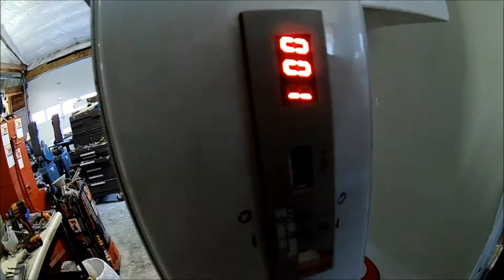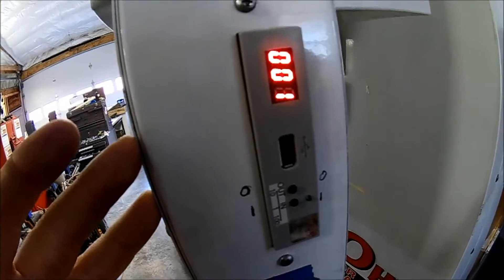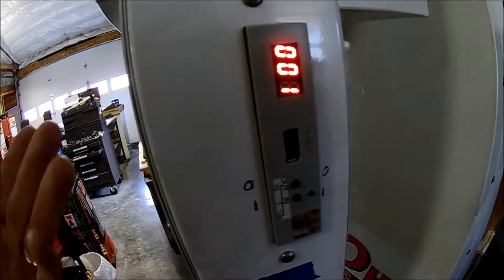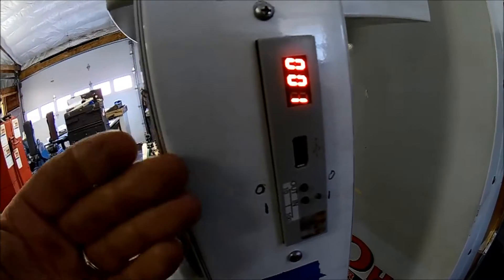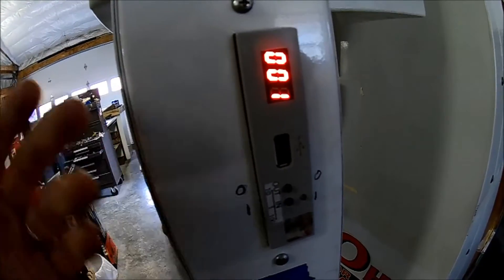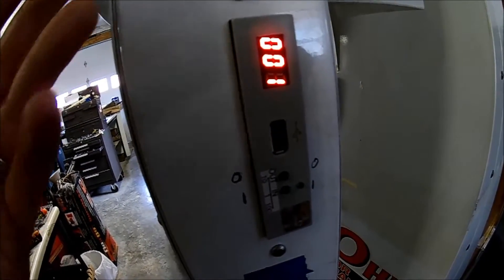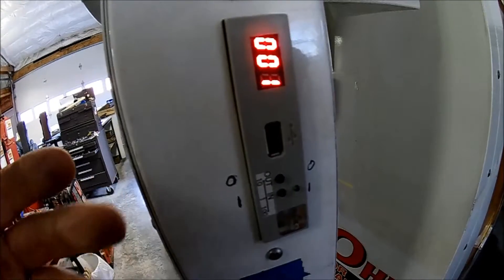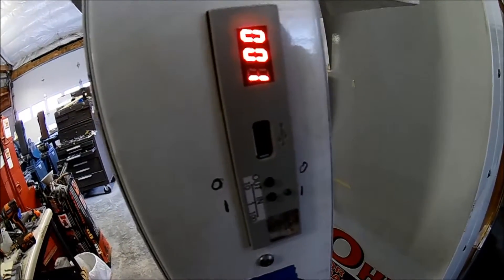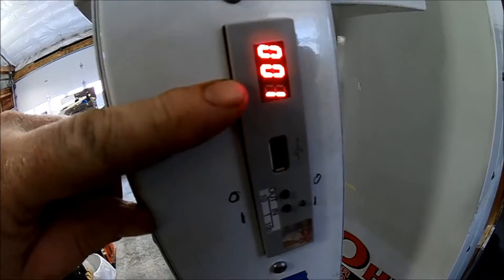Keep in mind this is just a buffer, so you don't even need the thumb drive inserted. This is the only drive I know of that does this — you do not need the thumb drive in order to transfer programs from your controller to here. You can send multiple files and put them onto this drive, then simply plug in your thumb drive and download everything at once.